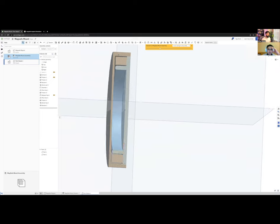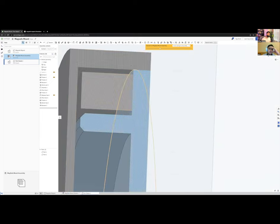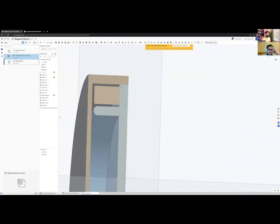The blue part and the top cap are line-to-line right now. If there are any tolerances — if one part is slightly bigger — they won't fit. We need a small clearance. Also, the top cap has no hard stop, so when assembled it'll just keep pressing down. We need to create a hard stop.